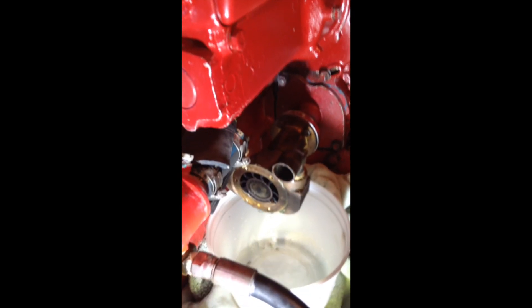I'm trying to give you a better view of that plate — you can see it a little bit better there, and you can see why you've got to get that hose out of the way; it's a real pain if you don't remove that hose. So just take those screws off and take the plate off. We've removed that cover plate and you can see the impeller in there. Good idea to have a canister underneath it because there will be some water dripping.